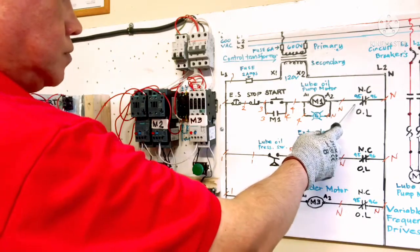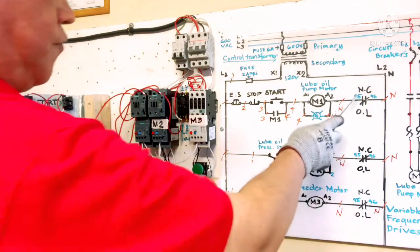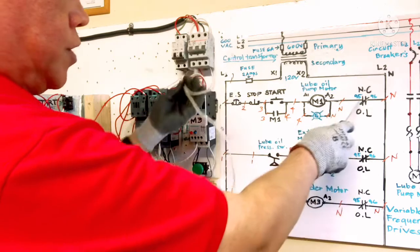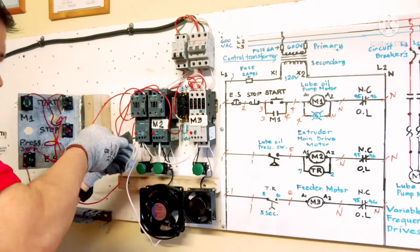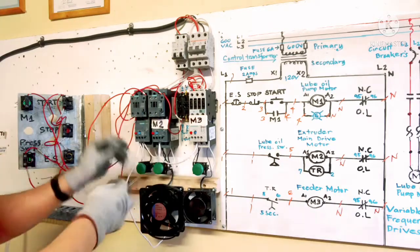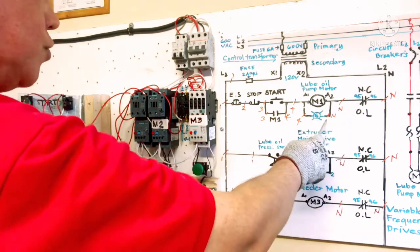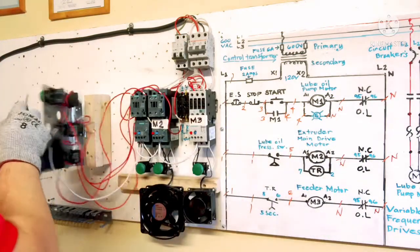So 95 going to A2. I need extra long wire going to green light. 95 going to A1. So 95 here, I need 2 wire because long wire, short wire going to A2 and long wire going to the light. 95 done. 1 wire going to A2 M1. A2 M1 here. Make it nice. And this one, we need long wire going to green light. This is our supply for green light. Neutral. Green light here, M1.